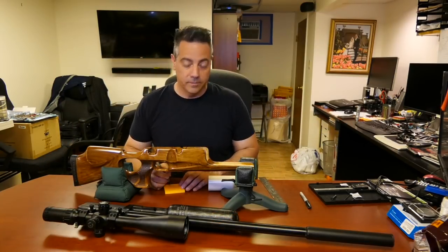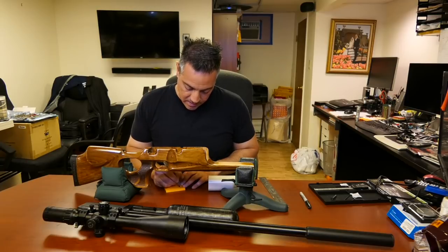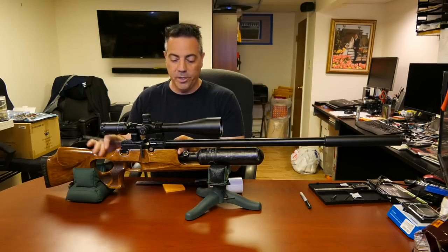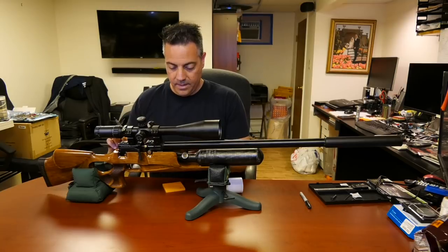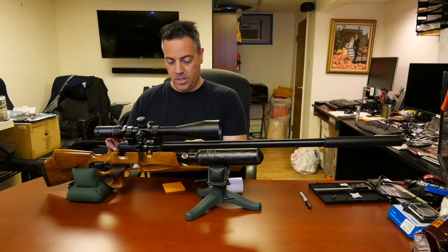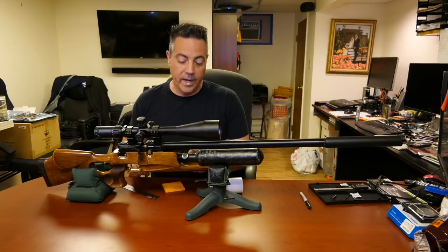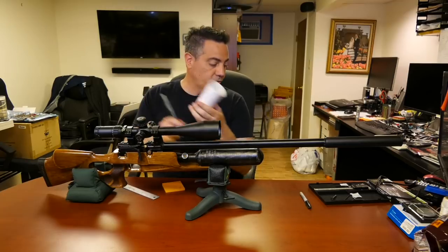So I'm just going to start writing these, do a mock drawing and start figuring out. So it's 1 3/16. Now, how far from the wood to the block? Okay, and I'll measure it from this side. 2 inches. 1 3/4 wide, 2 inches long at the top. So on my pipe here, I'm going to start drawing it out.